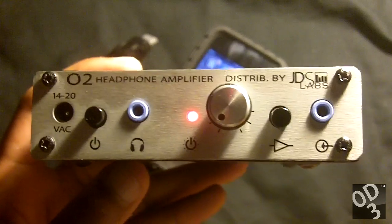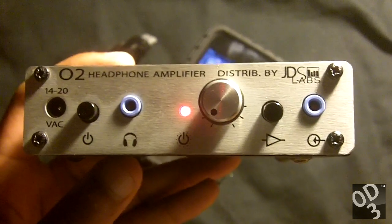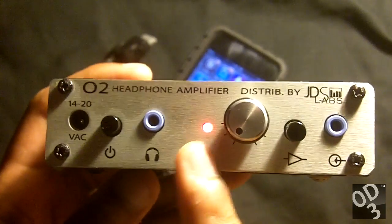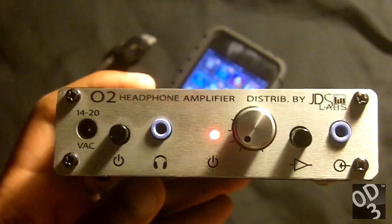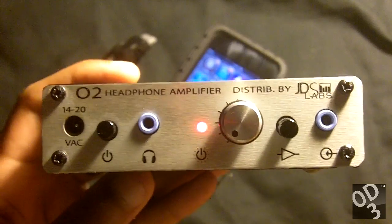The way this works is if the voltage level of the 9 volt batteries drops below a certain specification, the amplifier shuts off the sound but the LED light remains on to tell you that the amplifier's batteries are too low and that it requires charging.